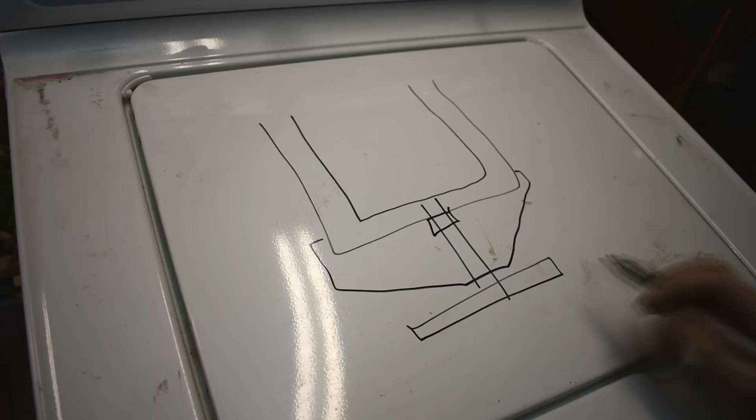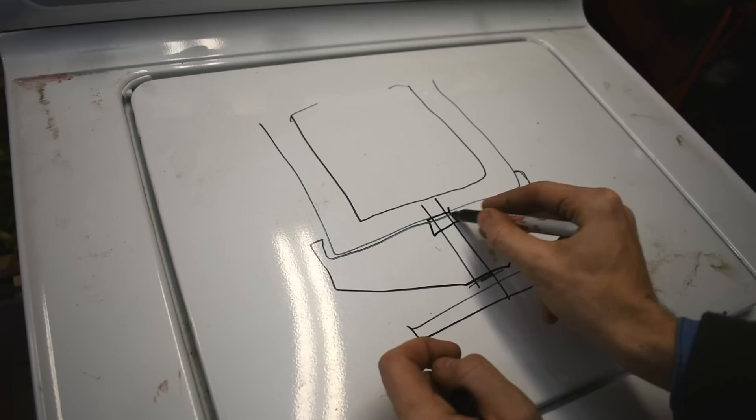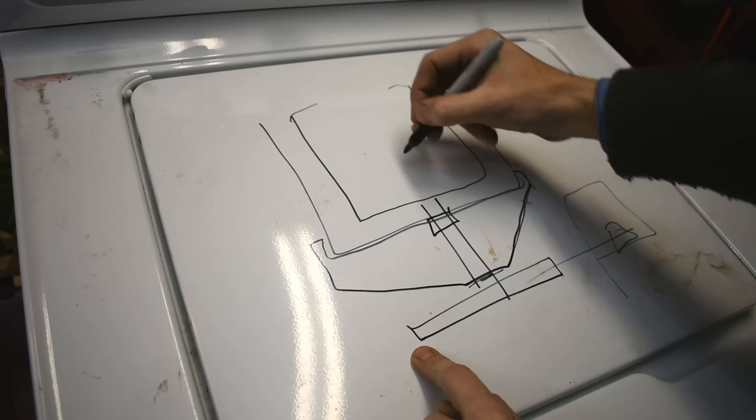Here's the inner tub. Here's the outer tub. This part spins, this part's stationary. It's attached to a frame which goes down to kind of hold this, and it kind of comes under here also. Down here is a big pulley. So how this works: there's a motor on this washer, off to the side, and it spins the pulley — wow, this is a terrible drawing — which spins this big wheel. The big wheel spins this shaft.